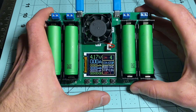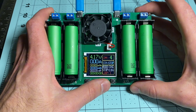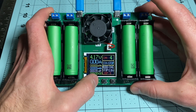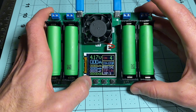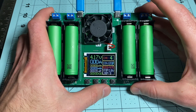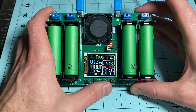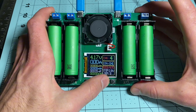If you switch the mode to automatic, you can use the loop function, which charges and discharges your battery. You can do that up to nine times. So if I'm on automatic and I switch it to nine loops, the start/stop button will start it — it's going to charge it up, discharge, charge, and loop nine times doing that.